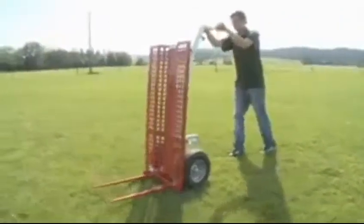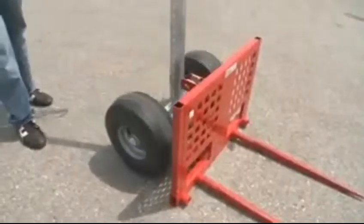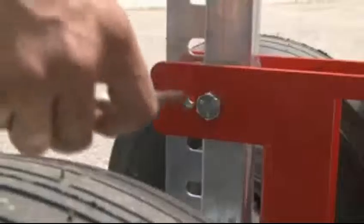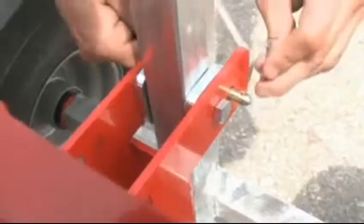Move the transport cart to the forklifter from behind. The 2 pivots at the transport cart fit into rails at the frame of the fork. As before, the pin is pushed through the fitting hole at the adjusting strip of the transport cart and fixed with the safety hook at the other end. The fork prongs may be varied in their width with the aid of 2 guide rails.